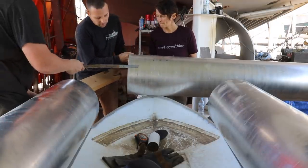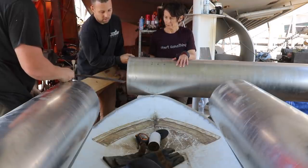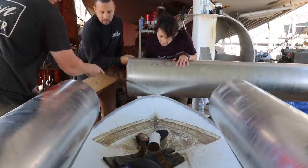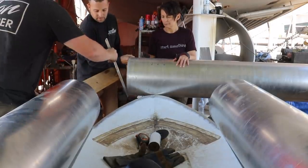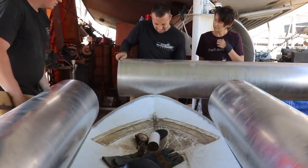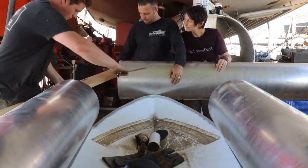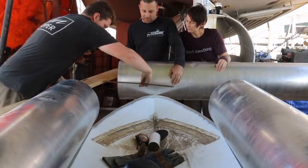So I wonder if it's worth it. We need to make that wider, pushing it out with that. Yeah, take up less internal space. All we can do is just add reinforcing plate, and if it's a plate that's filling the corner, they'll go, just follow the angle up almost. Yeah, so there's your 300. That's getting close to not interfering with the boat.